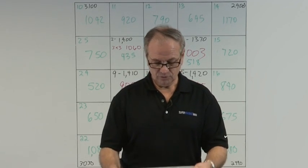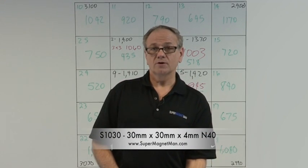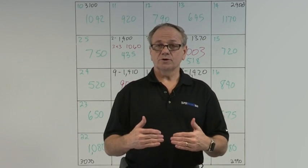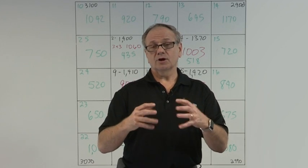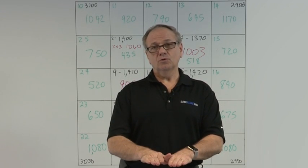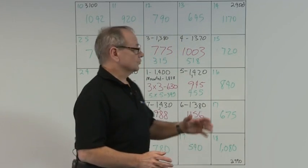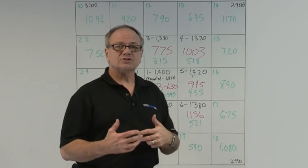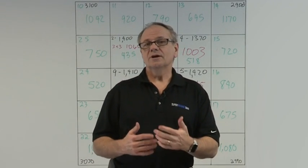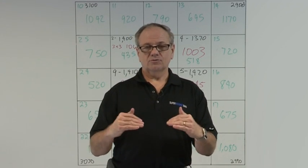We're going to work through the exercise of making this five by five array of magnets. These magnets are 30 millimeter square by four millimeter thick, N40 grade. They are continuously repelling each other because all of them have a south pole pointing up. We'll look at how we put this together and how it affects the Gauss readings, going through it step by step.